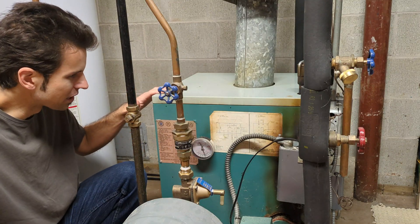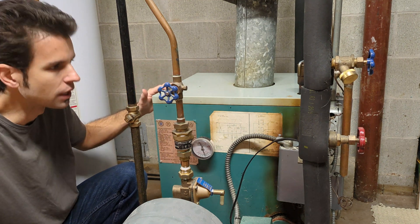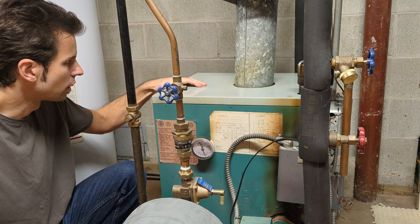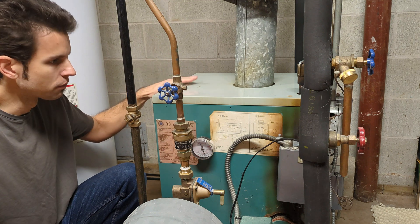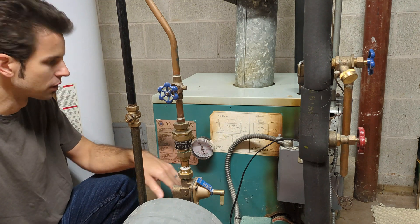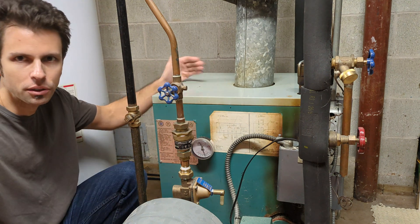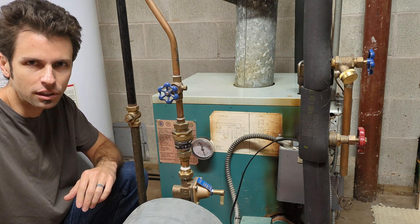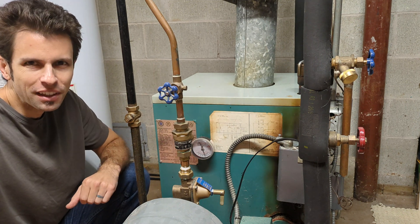That's just one of the things I love about these old gas boilers. This one is around 50 years old. The newer systems are only built to last about 15 years before you need to replace them. The home inspector and heating and plumbing folks who've worked on this say: do not replace this if you can help it. You can replace all the components — and most of these are newer components — but only when the boiler itself cracks and breaks inside is when you'll need to replace it. Otherwise just keep it going. It's really not worth going to high energy efficiency when those aren't built to last like these older boilers were. Thanks for watching — don't forget to hit that subscribe button.